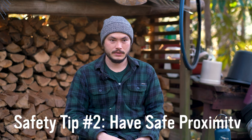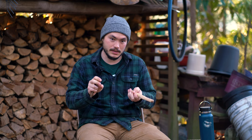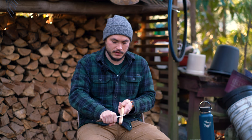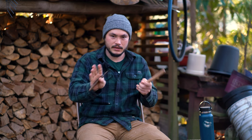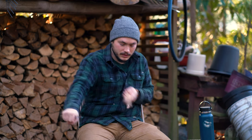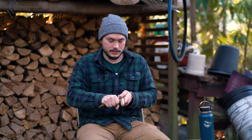When you're carving, you want to be quite aware of your proximity to others — mainly because every now and then you'll slip, and you want to be aware of where your blade is going to go should you fully extend your arm. Safety tip number three goes back to what I was saying about taking too big of a bite. If you're carving and you find yourself hitting a spot that makes you really struggle and shake while trying to push through it, that's dangerous. You build up a bunch of energy and then it releases all at once. So if you ever find yourself struggling in a cut, stop and just take a smaller bite.